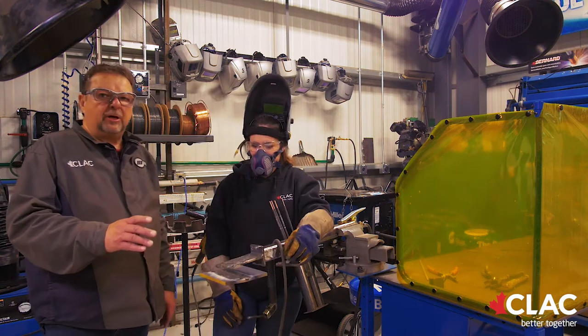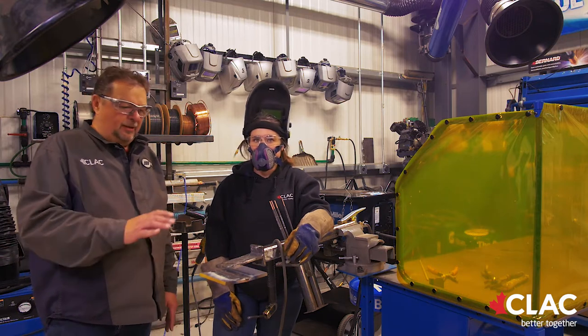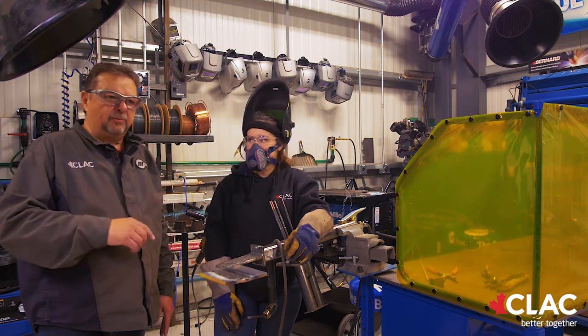We like to point out that the use of a respirator when using this product is highly recommended. Chromium carbide poisoning is something nobody ever wants to have. I'm living proof — I've had it. You don't want it. So I strongly recommend a respirator of some kind or an airflow helmet.